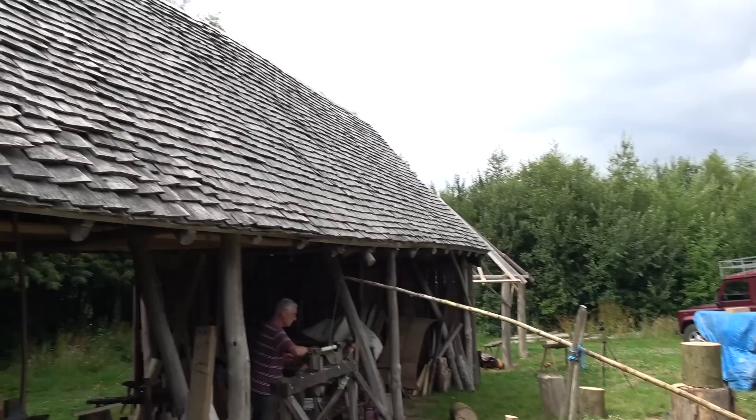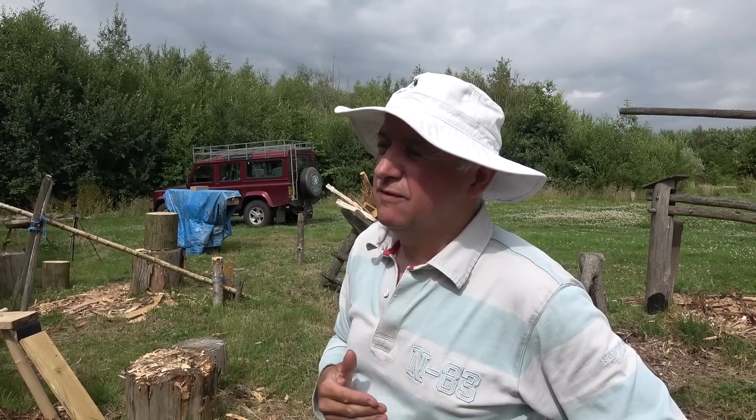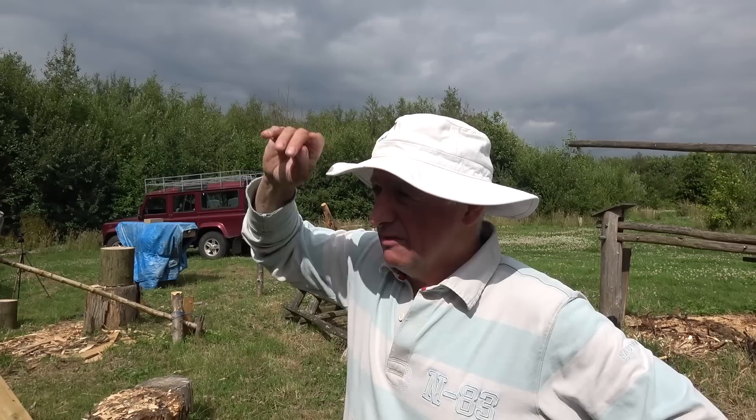They say around about 30 years — I've heard 40 years as well. They're laid on a gauge of one third. These shingles are cut to 15 inches and they've got about a four-and-a-half inch gauge, so there are three layers of cover at any one point in time, like a traditional tile. Which is what we find on a traditional clay tile roof.